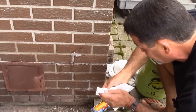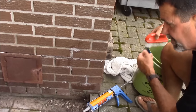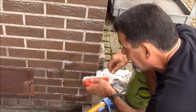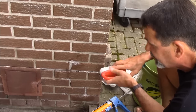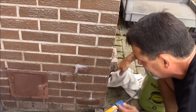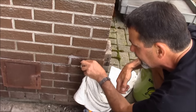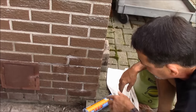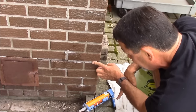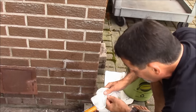The important thing here is to try not to get too much caulk on the brick — it is going to be a pain to get off. So I have my little scrub brush and a lot of water, and I have to try to minimize where I touch because I'm going to smear it and make a mess. Sometimes you're better off leaving a little spot on a wall than creating a big smear. I'm trying to drive this caulk deep into the crack. I don't need very much on the surface — it needs to be down in the void to waterproof my brick.